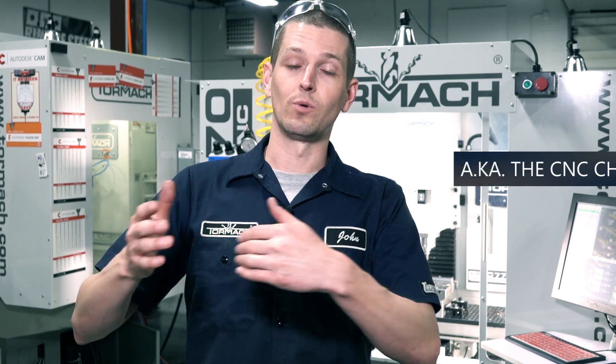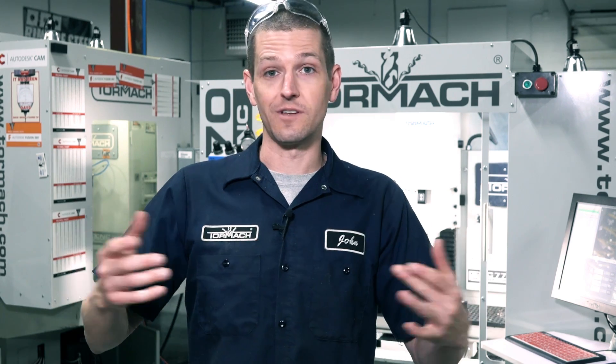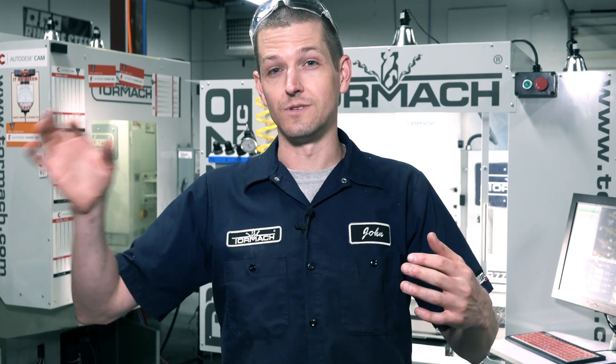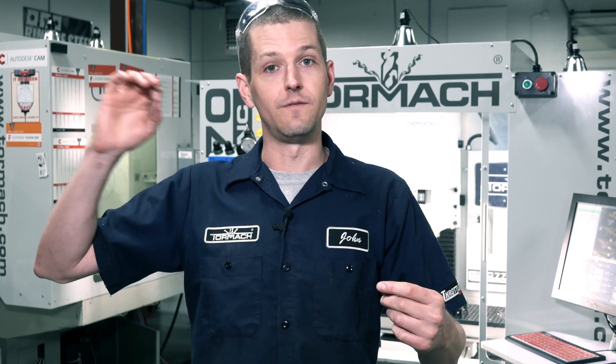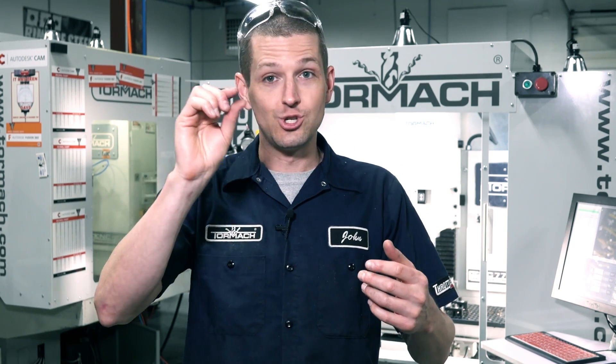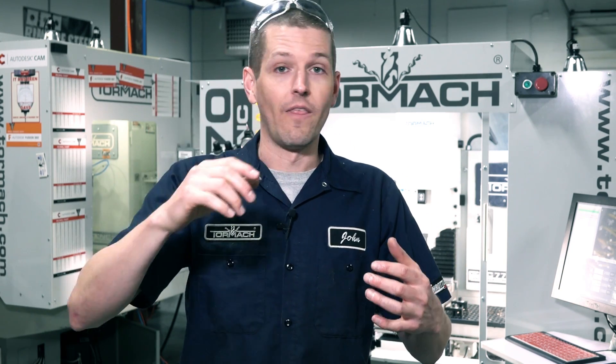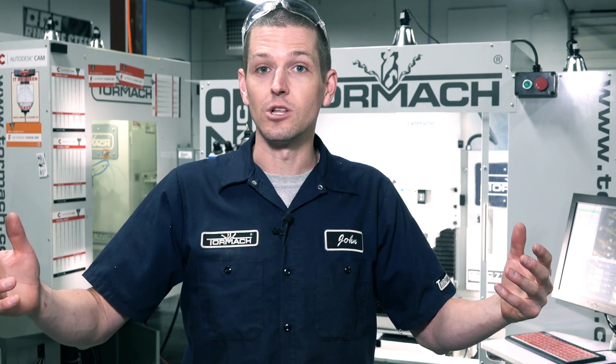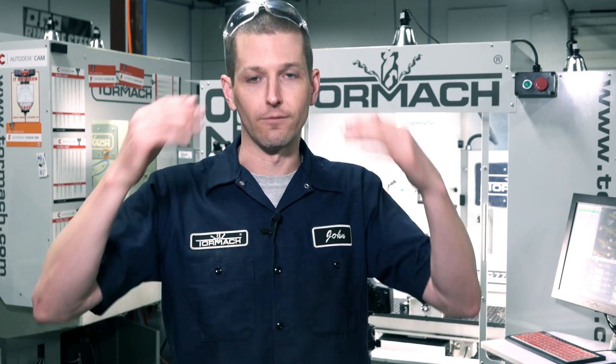The other thing is harmonics, and harmonics are a funny thing — sometimes you want to increase your surface footage, sometimes you want to decrease it, and sometimes it just has to do with phenomena of physics. Thanks Tim for your comments in the last video — harmonics are very real. I've talked to guys who have dialed in face mills on VMCs where sometimes it's just an RPM band that just works, and there may be some science behind it, but you just have to play with it. If they move that machine it may change a little bit, but I wanted to figure this out through test cuts.